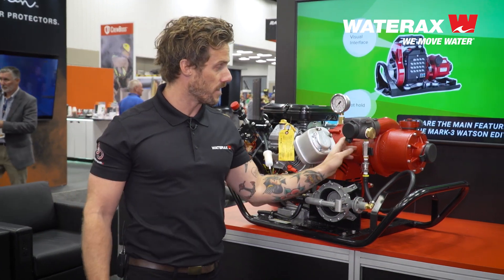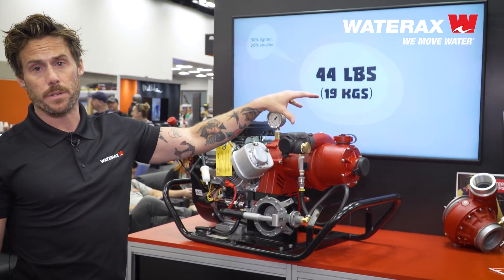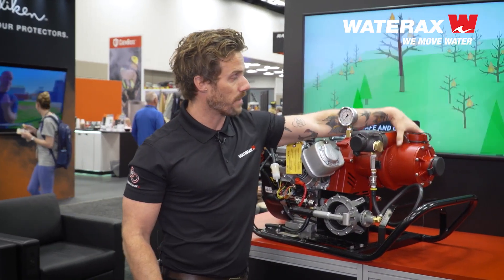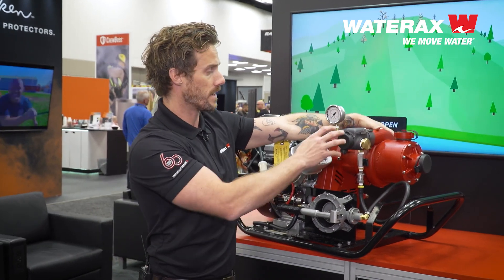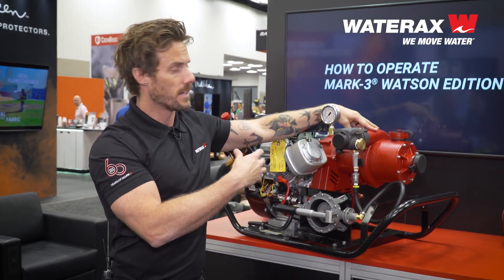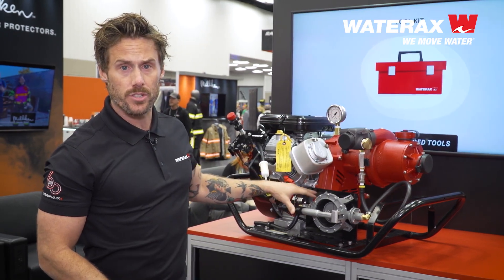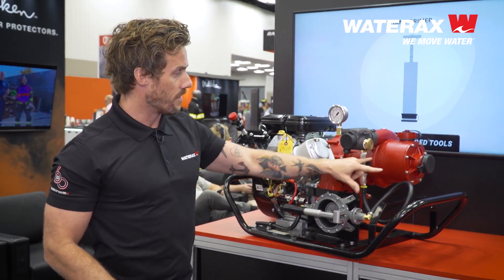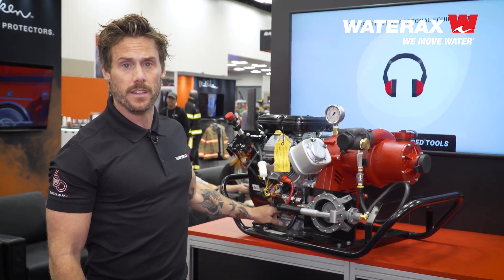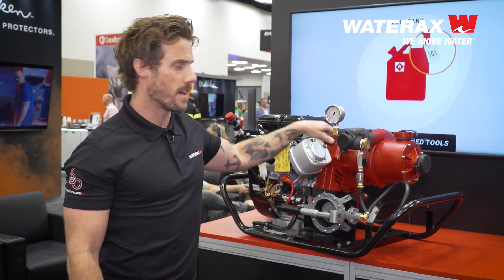It's a system that mates with both our BB4 pump end and our B2X pump end, which I'm going to show you in a second. It provides us with the capability of having an interchangeable pump end. So there's no bolting pumps to it, no direct drive — which could have concerns where, if the pump end were to fail, it would drive that shock right into the engine. So it provides some shock protection there.